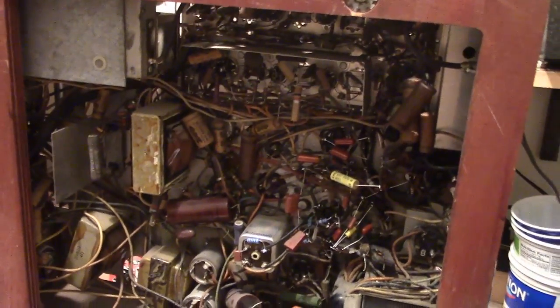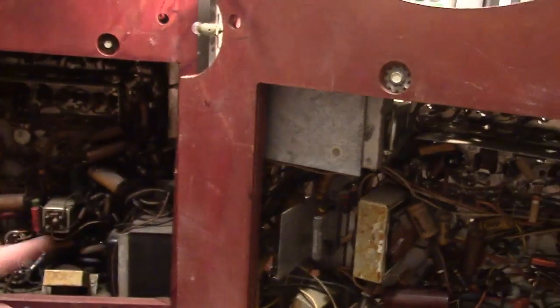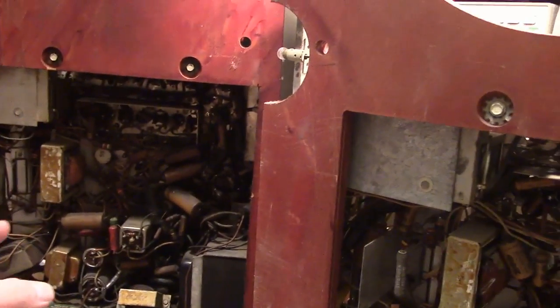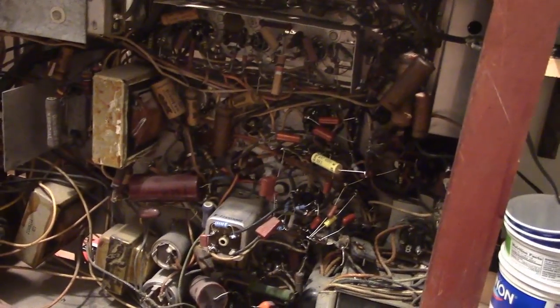And this says it should be a 5.1 for the 113. So, go figure. So what I decided I'm going to do is if things appear to be original, I'm going to go with those values. For something like this, down here, and these obvious replacements, I'll compare them between the chassis, and if one's got the original, I'll go with that value and see how well things match up to the schematic. In other words, I'll use my best judgment on what to use.